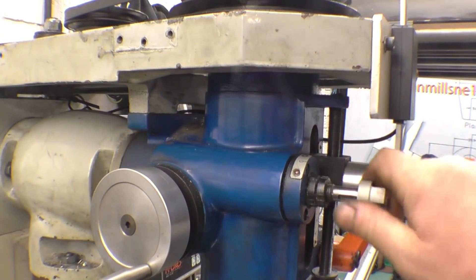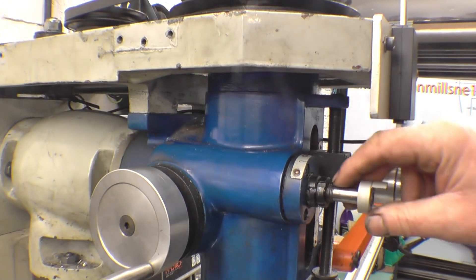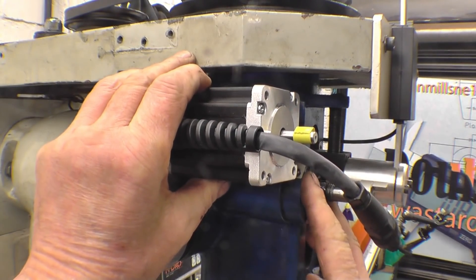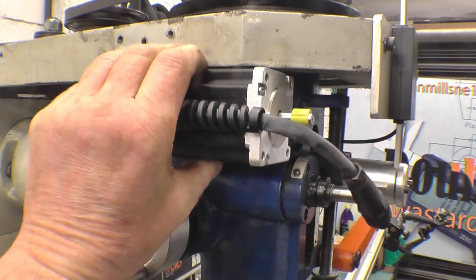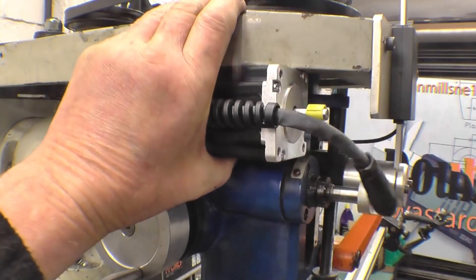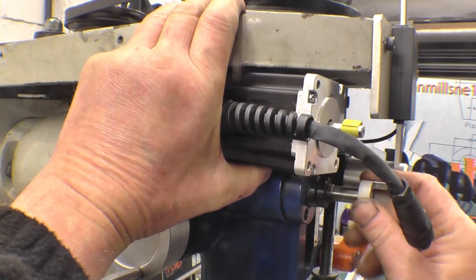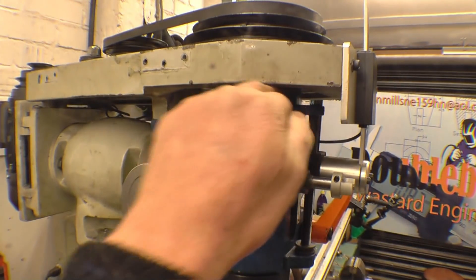I'm going to put a tooth gear on there and a tooth gear on the motor. The motor will probably go up there like that, mounted up there. I'll take the plate off here onto the motor — I'll have to put a piece in to step it out to get it in line. It's going to be out of the road up there. It can be left connected all the time because you can disengage it with that clutch-type affair. So we need to make a piece of plate to go from there, and there's a little bit of machining to do — possibly an angled bracket off there.